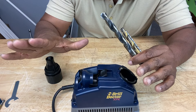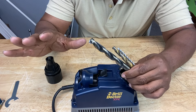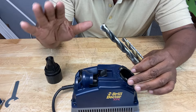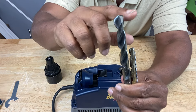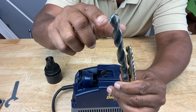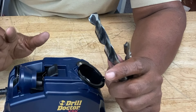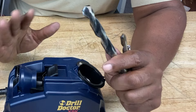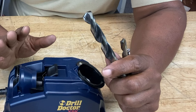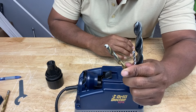Now there are three kinds of drill bits. You've got standard point drill bits — that's the general drill bits. Their angle is about 118 degrees. Standard 118-degree drill bit tips are usually used for softer materials like cold-rolled steel, aluminum, and wood. Then you've got split point drill bit tips.